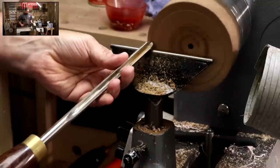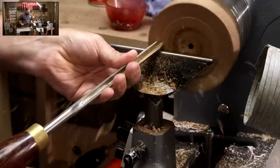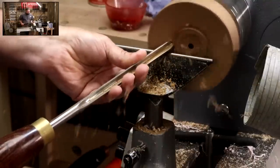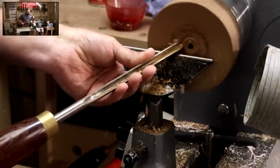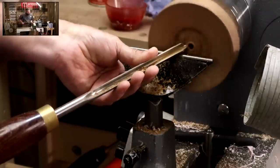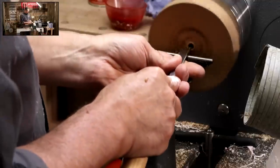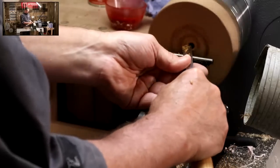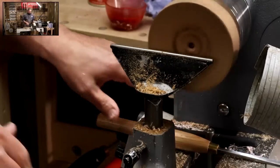There we go — we'll do a little test cut first. Stopping some of that breakout by back cutting. Let's just true up to my line. I'll just stop at that point so I'm not going really deep just yet — let's go up to the line and have a test. Still a little bit undersized — that's where we want to be. Let's go another half depth again. I reckon that's it for the internal grip — a little bit more waste away.